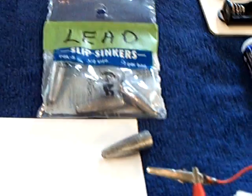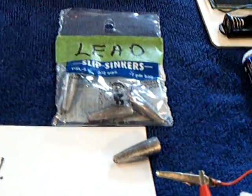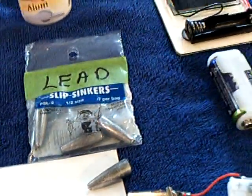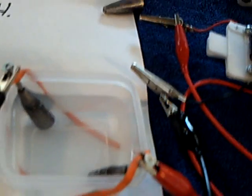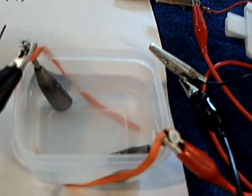Little Penny over here is running at about half a milliamp — not much. I have much smaller surface area on these little sinkers, but the only thing I could think of to get lead quickly was to go to the big-five store and get some sinkers. If I made these into plates with more surface area, this would have a higher ampere-hour rating.